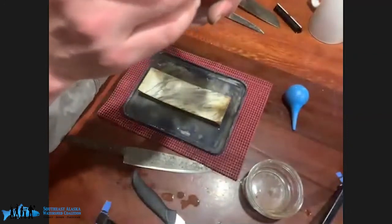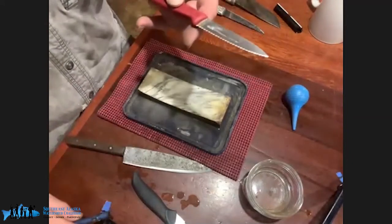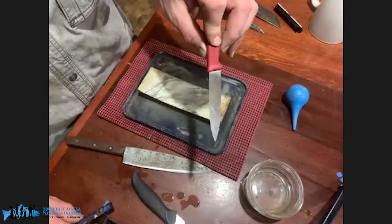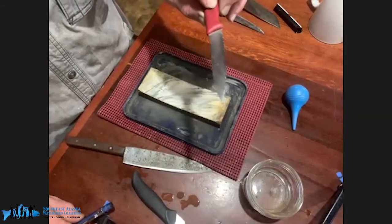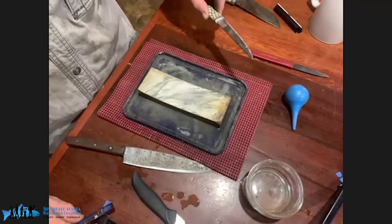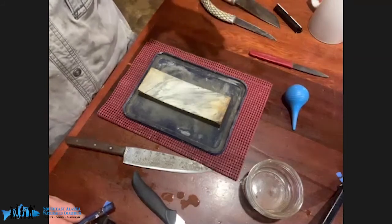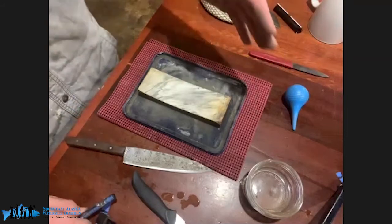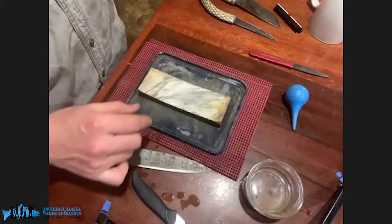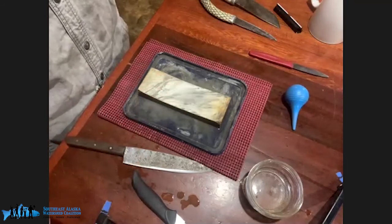Couple of reasons. This is a Victorinox knife. Really great boat knives if you use them. They tend to keep their edges really well, but they are stainless steel. And stainless steel is a lot more difficult to sharpen. Whereas the knives that I make are high carbon steel and they are tempered, with the intention of making it easier for the user to sharpen. Hopefully that answers your question, Pauline, in a very roundabout way.